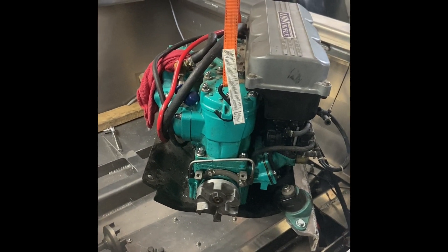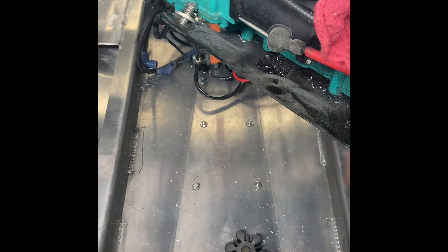I'm going to show you how I did my engine mounts. The Kawasaki is getting ready to be dropped in the boat. There are a lot of axes you need to solve for to get the single line — you've got to get it lined up left and right, lined up twisted, lined up vertically, and fore and aft. There are a lot of axes.